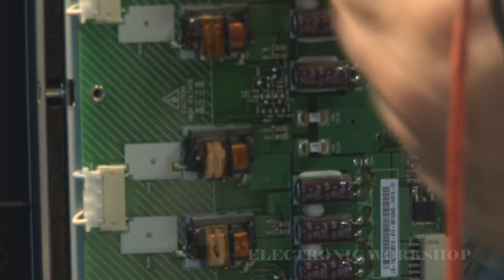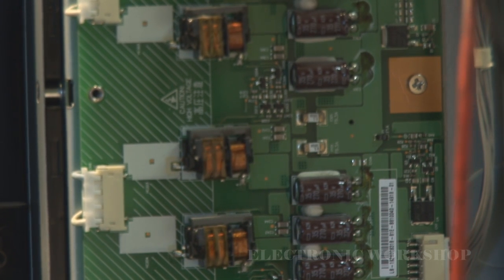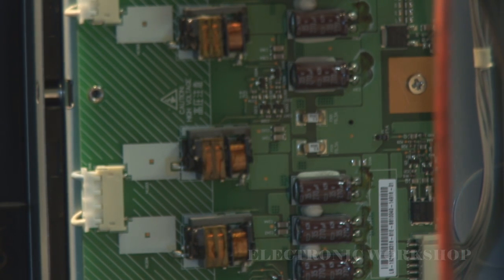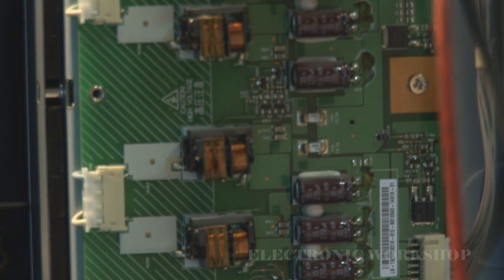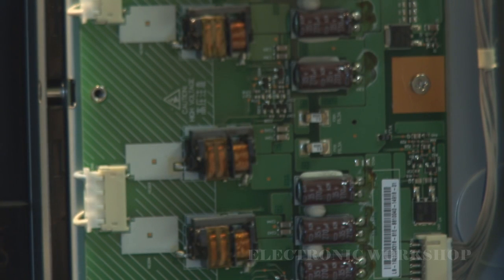Okay, I'm going to power it up again. Just want to see, does the voltage on my ground change under load when the lamps come up? 0 volts. Okay, my powers and grounds are okay. So what I have to do now is figure out if my backlight's gone. If one of the back lamps has gone low and is not putting out enough output, that can cause this inverter board to go into protection mode. So I've got to figure out a way of checking them lamps.